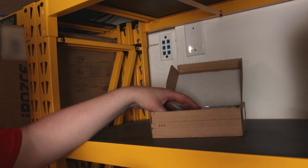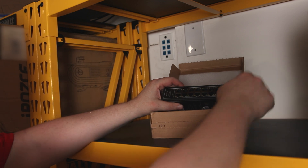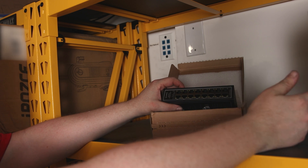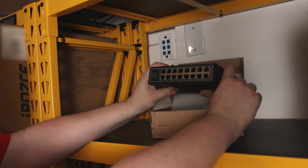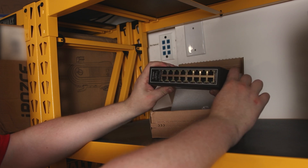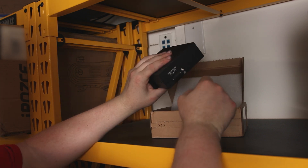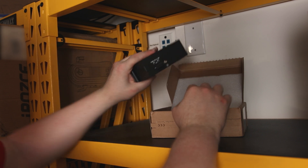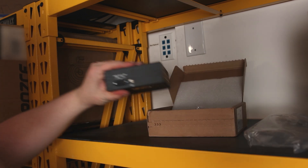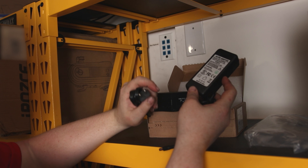Now for what we're going to put here — this is a switch. Most consumer-grade switches are nice except they don't resist heat very well; they usually cut out at about 104 degrees Fahrenheit. Since I'm putting this in my garage it could get much hotter than that. This is an industrial switch by WeWave, intended for enclosures that can get very warm. It doesn't come with a power supply — it has a plug to supply power from within the cabinet. I'm using a basic 12V 5A power supply from an LED driver, and this WeWave switch accepts anywhere between 12 and 48 volts, so that should be plenty.